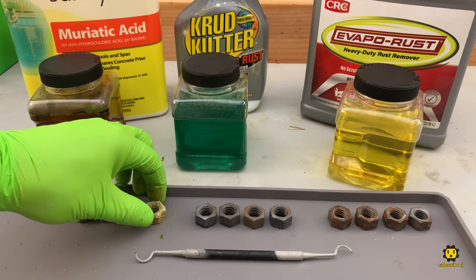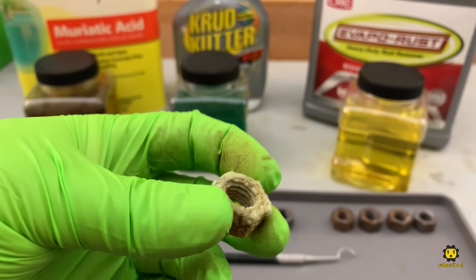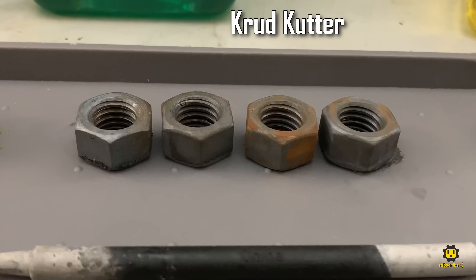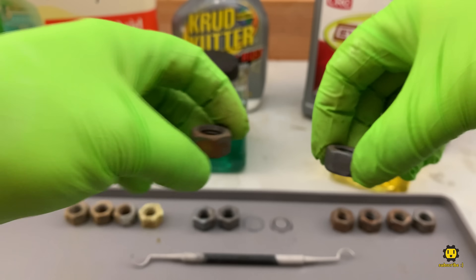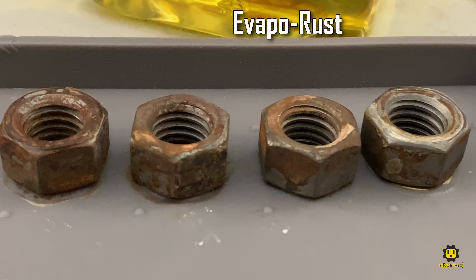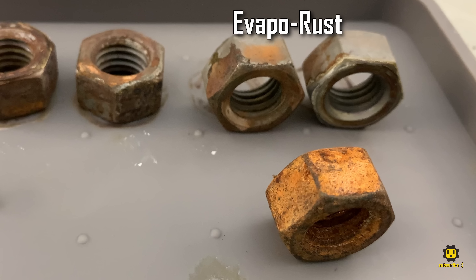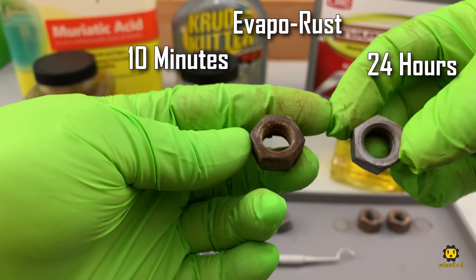So it's been 48 hours since the last shot, and wow, look at that — that's what happens if you don't neutralize the acid on the metal surface. Crudcutter's rust inhibitor had mixed results; the six hour nut did not do well, and I want to see if it was just a fluke so we'll do some more testing on that. The Evaporust did not appear to inhibit new rust at all. Here we see it compared to a control nut. It takes longer to achieve the same results compared to the other products, but the general nature of the solution is going to be a lot easier on the base metals.